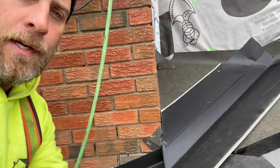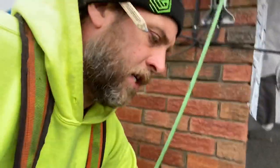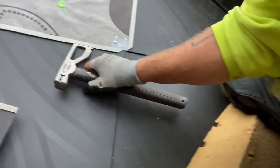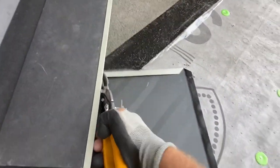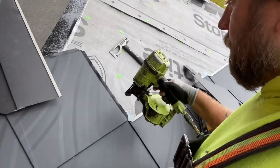We're going to keep it up a little bit. We're going to take a shingle and put it right like so — make sure it locks in, make sure it's sitting nice. Once you get it in there, take these folds right here. You're going to take your hammer and pry that out like so. Don't worry about banging up the shingle because you're going to put another one over top. Make a cut right here, boom. Once you get it where you want it, blast that down any which way you want. Now you're going to set your valley. Boom, done.